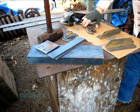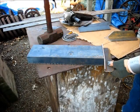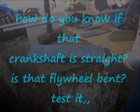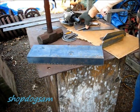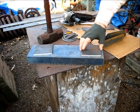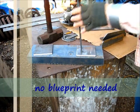The project for today is building a fixture, a jig. It'll have a footprint on that side, a footprint on this side, two movable plates, four holes drilled in that, a multitude of holes down through here so this can move to and fro. There'll be a support going up here, and this will be on top with two rollers on it.